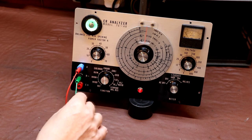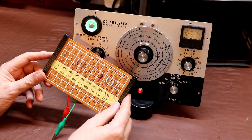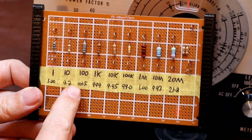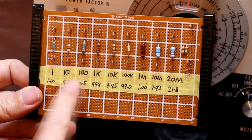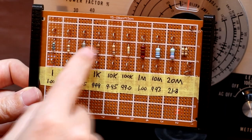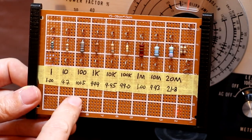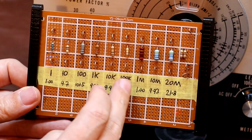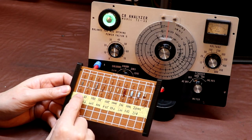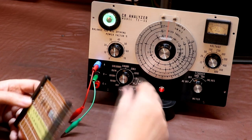I've never actually used one of these CR analyzers before, but I have used some quite similar AC and DC bridges in the past. I think we'll start off our testing by just seeing if the resistance range works. To do that we're going to use this little test board — all it consists of is just a number of different resistors arranged in decade values. Since last time I've actually measured all these resistance values using a fairly accurate digital voltmeter, and written the measured number below rather than relying on component markings. They were actually fairly close to the marked values. We should be able to measure these resistances using our bridge. My board goes down to one ohm, but I think one ohm will be too low — off the scale — so we'll start the measurement at 10 ohms, on the RX times one range.